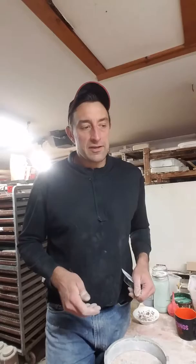What's really neat about this whole process is using air pressure to pop these tiles out of the molds. You can make them one after the other instead of having to wait like the traditional way for the tile to loosen up and fall out of the plaster mold.